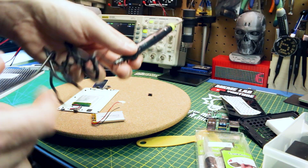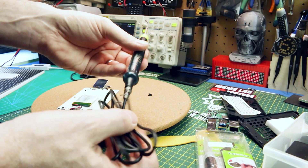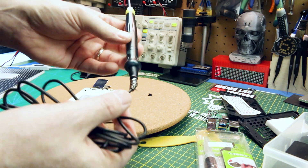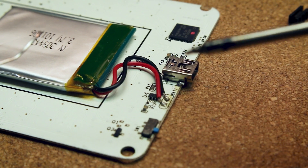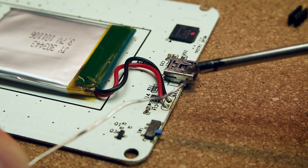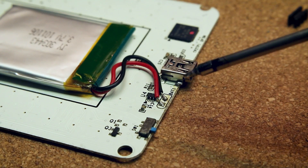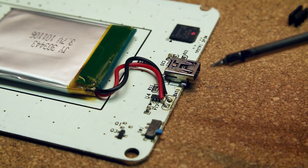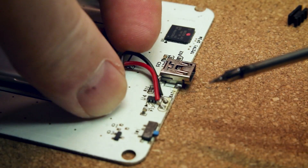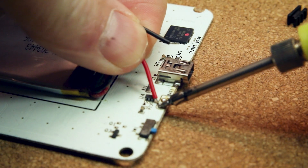If you do get one of these irons, they're super handy to have in your car or when you're traveling. Just wrap a little bit of solder around the cord so you always have solder with you and won't forget. These little soldering irons have one speed — wide open — but they work just fine. Apply a little bit of solder to your tip, clean your tip off (or just shake it off if you don't have a cleaner), touch to the wires, and pull them off.